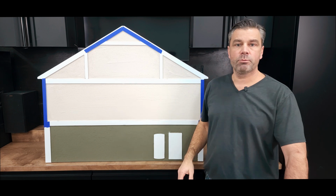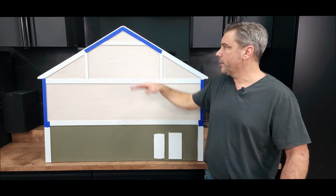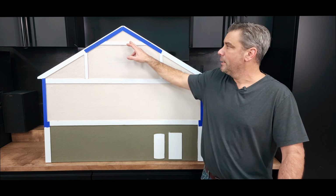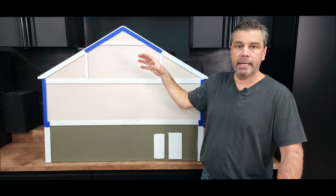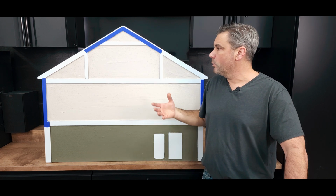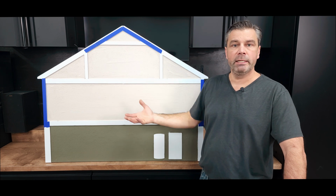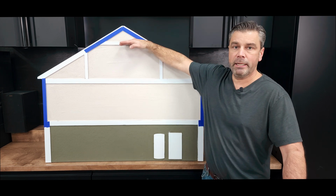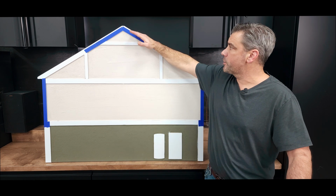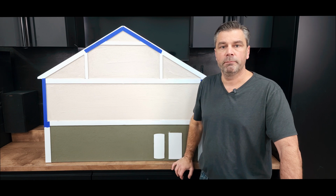A couple of the main reasons why we see people opt for this is recessed lighting. So when you're putting 6, 8, 10 recessed lights in this upper ceiling here, a lot of times there's not an easy way to get a guy on top of those recessed lights to box them in properly. So if somebody pulls that recessed light down, even if it's an LED puck, and we were to insulate the flat, a lot of times you see that cellulose come falling with it. In this case here, it's a semi-conditioned attic space, and you really don't have that issue anymore.